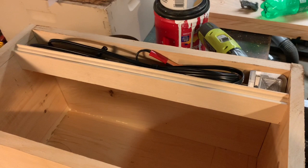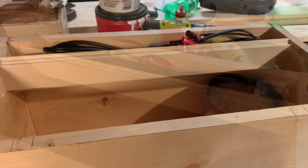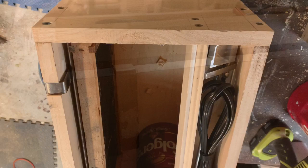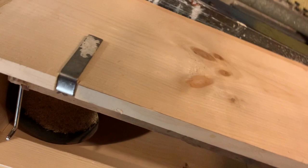Once I have the shelf to the desired size and have screws in the back, I'll affix the front. The tray is attached. We'll cut grooves on the side to locate the frame hanger so that it will be flush with the top. Now that we have the frame hanger attached and flush mounted to the top, we'll move on to the additional pieces.